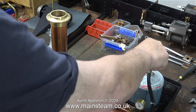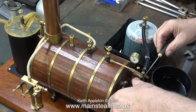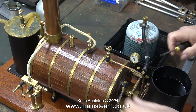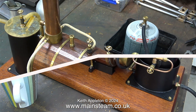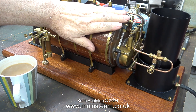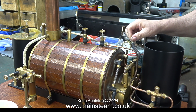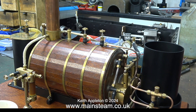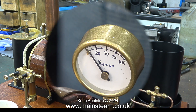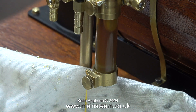There's a nice healthy explosion when I ignite the gas. I experimented with the position of the gas jets in the Venturis, and it would appear on this particular boiler that all the way in is the correct setting. Time now to have a cup of tea while the boiler raises steam. I do apologise for my cup of tea looking rather weak, but it isn't — it's the video lighting which is very bright. The first thing I notice is that the hissing noise from the gas jets is a good bit louder, but the heat doesn't appear to be any better than with the number 5s. I'll leave it for a while and see how it goes on.